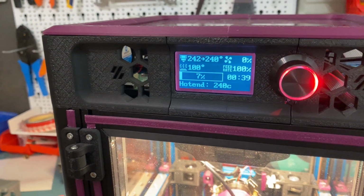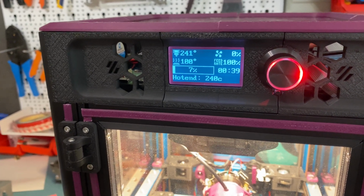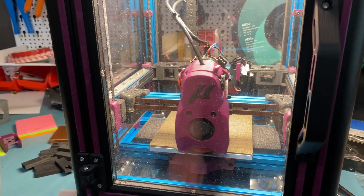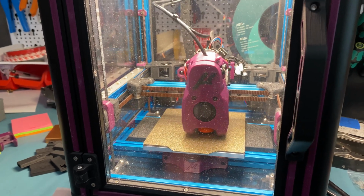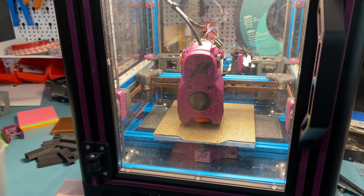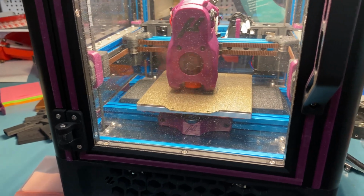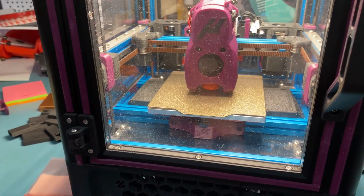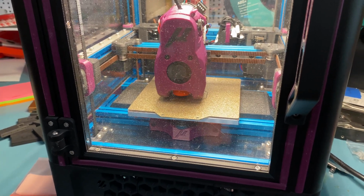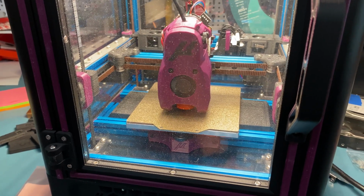Just heating the nozzle. Well, it already heated, it's just waiting for it to cool down a little bit, and it'll start printing. I have the Jontek custom print start macro here. That's also what I use on the Voron 2 and on the Voron 0 too, and it works really well. I'll link that in the description below too. So looks like I need to calibrate the purge line, because the thing it did in the front was supposed to be the purge line, but yeah, I need to calibrate that a bit. But overall I think that script works really well. That's why I use it.